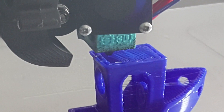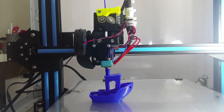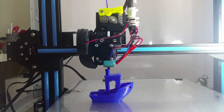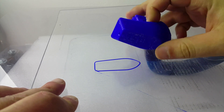So here you see some nice bridging. There is some stringing but it's normal because I don't use retraction with flex. The print took less than 40 minutes with these settings and the result seems quite okay. When I see an extruder capable of supplying a lot of flex material fast — I printed with high speed for flex at 40 millimeters per second and high layer height — I think it's a good extruder.